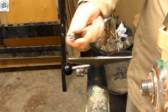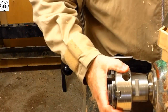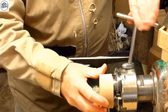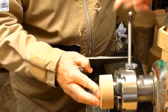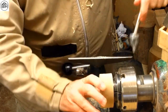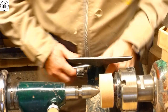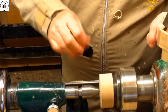And so I'm going to take the live center out, and I'm going to mount my chuck on the lathe. It's a one-way chuck. And wind the jaws up, all the while holding the piece of work tight against the jaws. The idea being that when we start the machine up again, this will run true. I'll turn it around and just nip it up the other side. And what I do, I just bring up the tailstock a little bit, just as a little bit of insurance, if you like. We rotate this by hand to make sure it runs, and you can see that's running quite true.